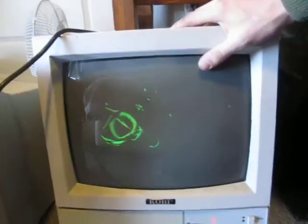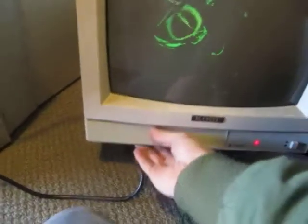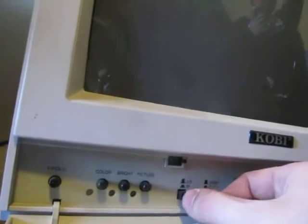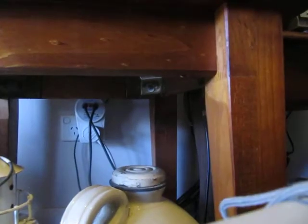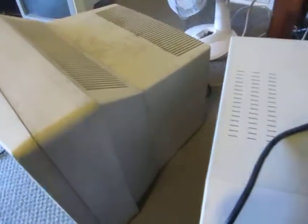Let's try that black and white one as well - it's working, not very well. Turn the brightness and contrast down a bit - open the panel. Brightness and contrast are all the way off - it needs a rejuvenation of the tube. What's this? A Kobe monitor? I'll have the black one if it's good and you can give me a BNC as well. We don't have any plugs for this monitor sadly - we'll have to try the BNC. It just needs a little bit of coaxing.